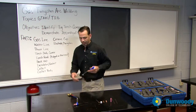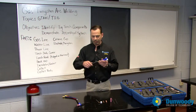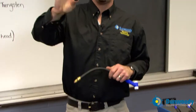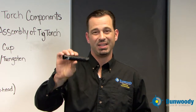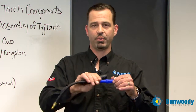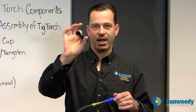The next part, following up on the water-cooled torch — and I'm going to use this air-cooled torch here — is the torch body cover. That will slip off; it's simply a plastic cover. You'll want to ensure that it's not cracked or damaged in any way, because you have all your power coming right here, so you could get electrocuted if this is damaged.